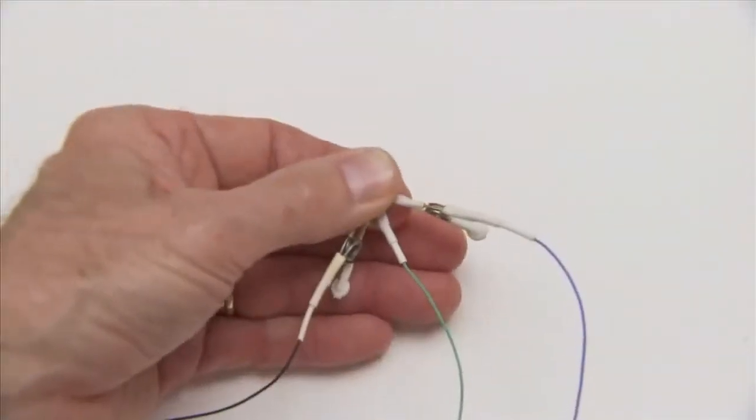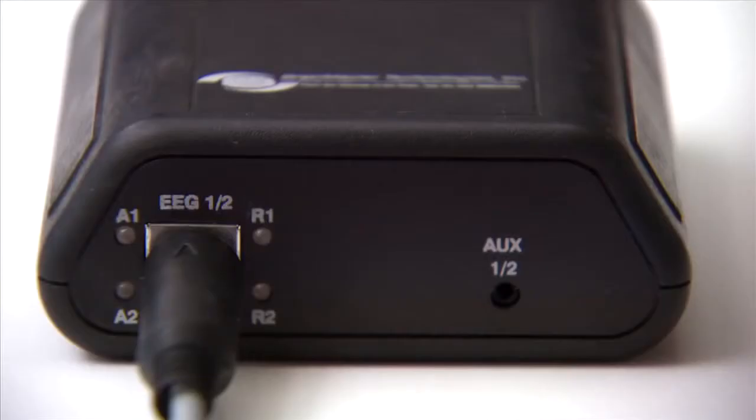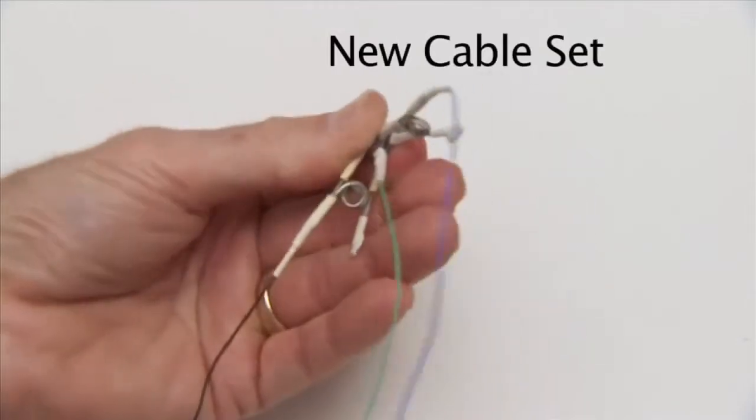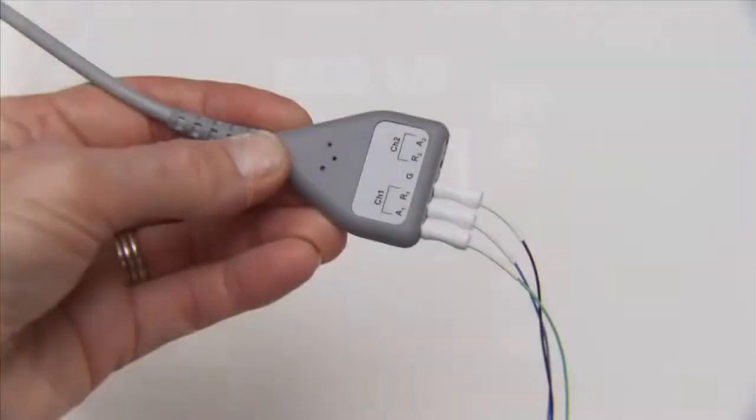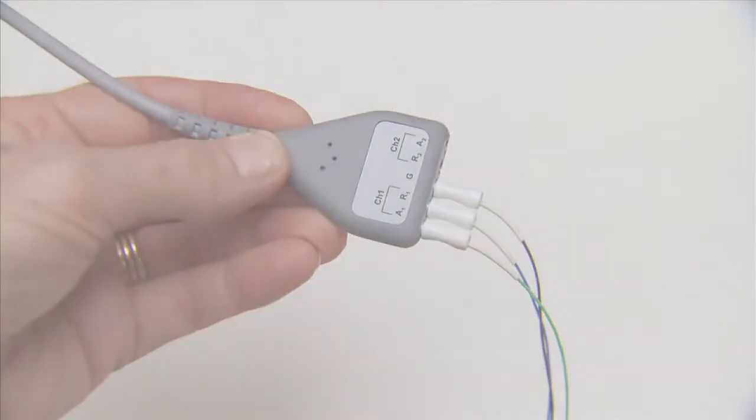Again, shake and move the wires to check for intermittent connection. If both top lights stay green, the black wire is good. If any of the top lights are red, the black ground wire is bad. If you have a new set of cables and clipping all 3 together, one of the top lights is still red, then your gray cable is bad.